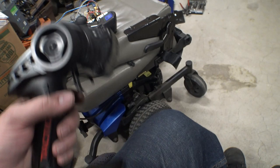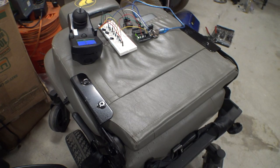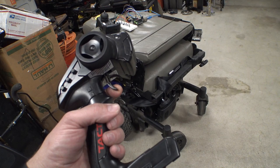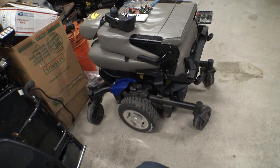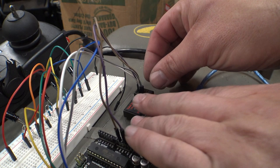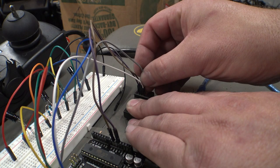Oh boy. So let's turn this onto a slower profile. And apparently for whatever reason, backing up was more like turning. Oh, we got our outputs reversed. That's what happened. Okay, that's actually really easy to fix. While I was moving everything around earlier, I wasn't sure if I connected these channels back up correctly. So we just have to switch these two wires here. There we go.